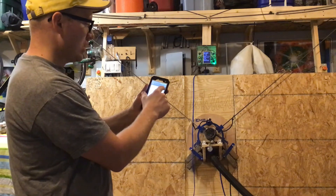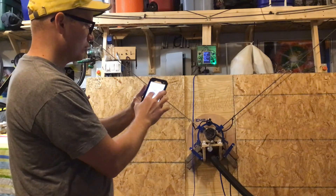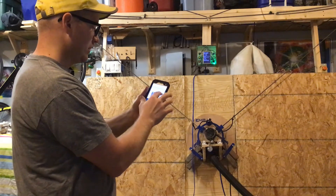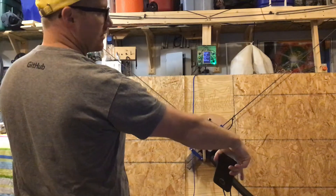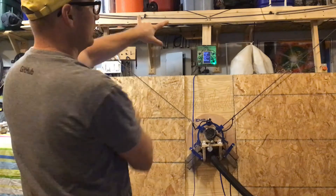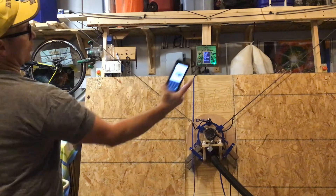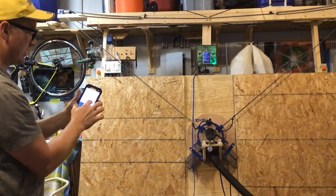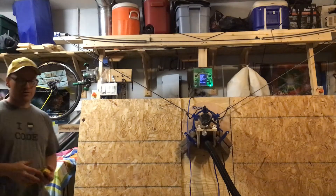I have a ring — or the metal Maslow linkage, which is different. So you click 'I have ring,' select ring, and your rotational radius shows up as the default 138.4. Is your chain off the top or off the bottom? Basically, if you have weights hanging down, that's off the top because the chains go around the top. Or do you have the bungee setup, which is what I have, where the chains come around the bottom up to the bungee? So mine's off the bottom — select bottom.